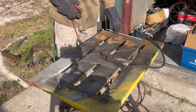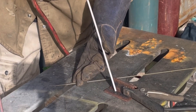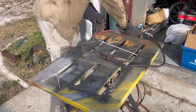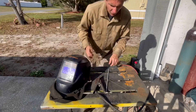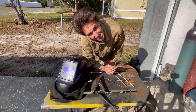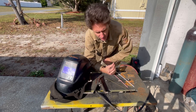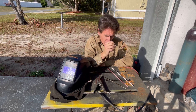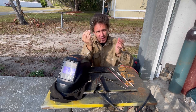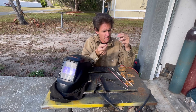That doesn't seem to work either. Let's try the 7018. After failing with the 7018, the coat hanger, the 6010, and the 3/32 TIG rod, I went and got myself a 6013 I had laying around. This is a sheet metal rod — the last time I really used it was on that stairway project. This is the smallest thing I have left. It could be that this battery is just undersized. This is the only battery I'm willing to ruin to do this. But let's see if it'll run this 6013, 1/16 rod — smallest thing I have.